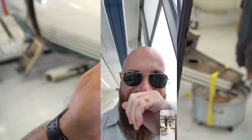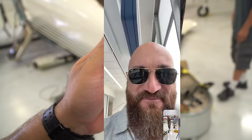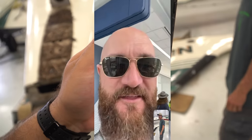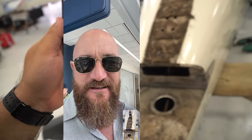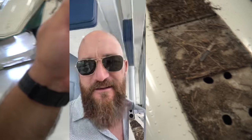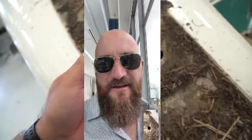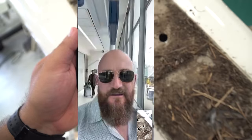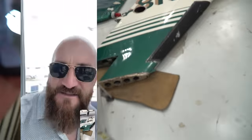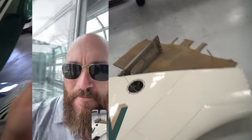Oh, man. No way. Hey, guys, what's going on? I don't know if they can hear you that well. We can hear you. I think the airplane might have lost a couple pounds there. Oh yeah, dude. Yeah, and we pulled it up. There's still some bird nest, and we actually noticed there was even a little bit of cable rub right there, and so it was good we took it all off. But yeah, dude, it looks pretty good.